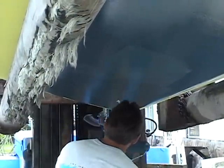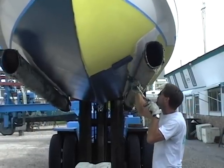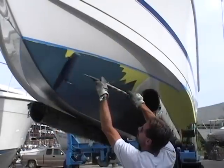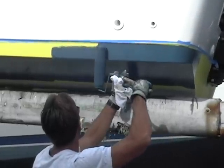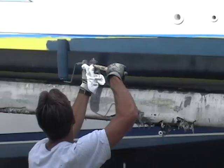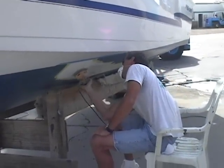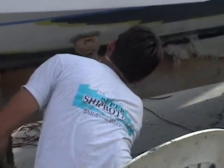The entire boat can be painted 1 coat in a matter of an hour and a half or 2 hours, but you must let the paint dry at least 4 hours in tropical weather and longer in northern climes. It will take about that long for the paint to cure completely. Now you must really be careful about the waterline, because that is where all the wear is, and most people put at least a second or a third on the waterline. Once the boat is on a different rack, the job of sanding, dewaxing, and painting goes pretty quickly.